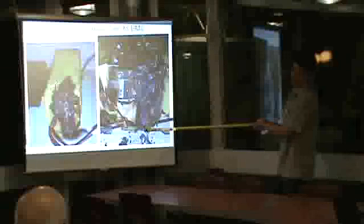What had clearly happened is that some of the wires, so the wires go from these cells, and here's where the battery management circuit is, and they were completely vaporized. There's actually blobs of molten copper on the pavement. And during the charging process, I think that the battery management circuit, which is one of the battery management circuits that bleeds off the extra charge on the overcharged cell, gets hot. And it could have gotten hot enough that it softened the insulation on the sense wires that connect the cells to the circuit, allowing you to get copper on copper contact, and then that causes a short circuit, which causes an electrical fire with the ensuing meltdown that occurred here.